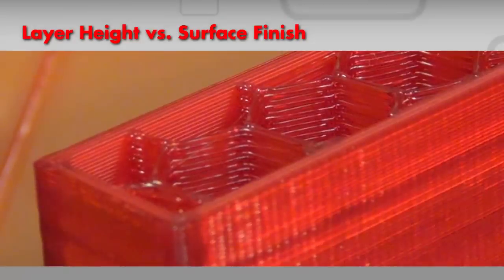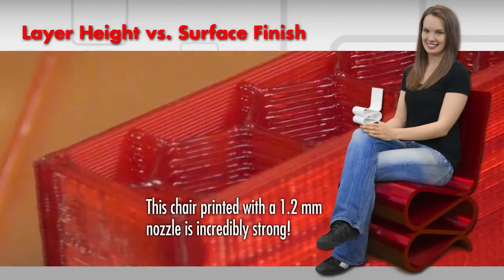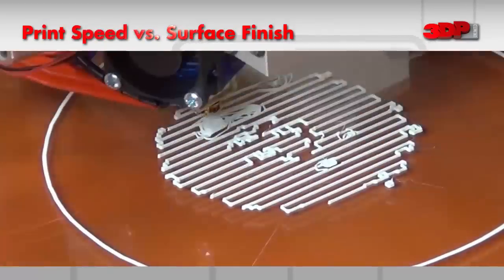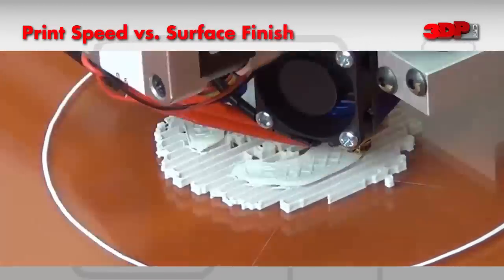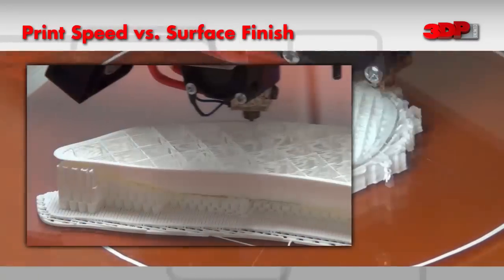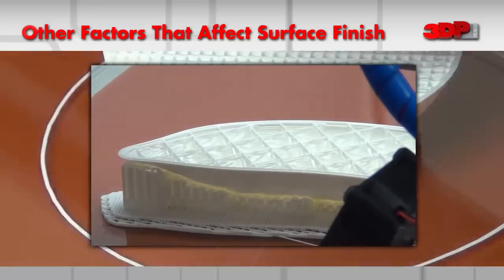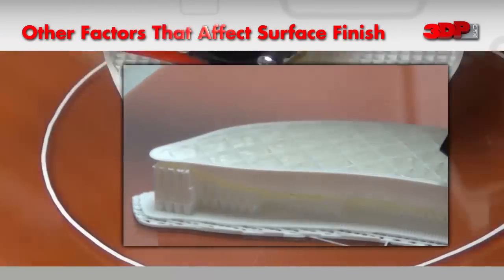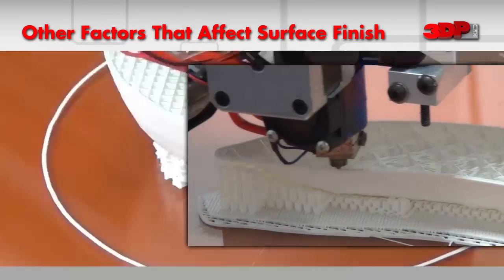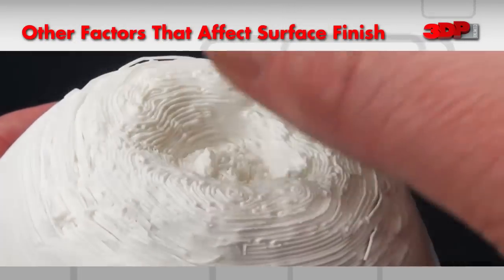What's the trade-off? The surface finish may be more coarse when using a large diameter nozzle. However, the thick bead of plastic laid down layer by layer also creates a very strong bond, resulting in a heavy-duty part. Once the layer resolution is determined, the speed settings for the printer have a direct effect on the quality and surface finish of the printed part. A slower first layer can help the object adhere to the print bed, and a slower speed for the outside perimeter is important for high quality surface finish. If the part you are printing requires supports, the choice made regarding support material has a direct impact on the surface finish. Breakaway support structures tend to print relatively quickly because they are not printed solid, but can leave scarring on the object.